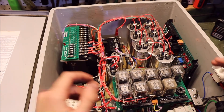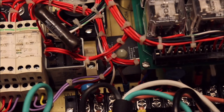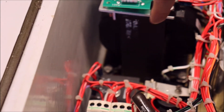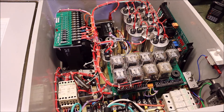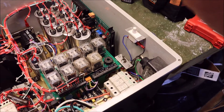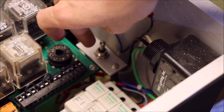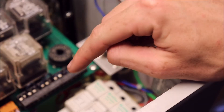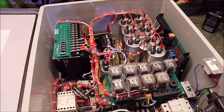So that's pretty much how it works — the capacitor bank is built to charge. Then there is a relay right here — this little solid-state relay — that controls the LED flashes. And this relay over here controls the arc, the strobe. You won't be able to hear clicking noises because they're solid state. Over here we have our day/night auto switch. Currently it's set up for night — now it's set up for daytime — and then this would be auto. Auto means the switch is throwing itself out of line and sending the line over to the photo cell.